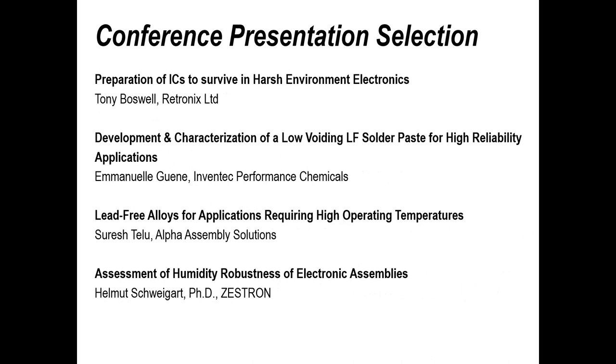Voids are always a debate, and Keith mentioned them in his presentation. A lot of voiding is related to design or other aspects. Many customers have problems with paste and profiling, but at some point the paste product needs to change — certain paste products produce better void performance than others. With all those variables, it's about understanding the true cause of voiding. Always find the root cause first — don't automatically blame the paste and the profile.